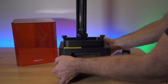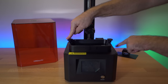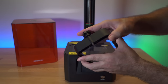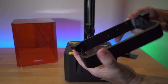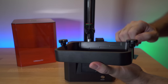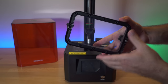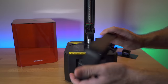I want to take off the tub to look at it closer. I'm spinning the coupler by hand to raise it up. There are two knobs, one on each side — they're not meant to come out, as they're solid on top but threaded on the bottom. Here we have the tub, also known as the VAT. It has interesting marks and steps for gauging resin level. Bolts around the bottom compress the film, which is extremely tight — it literally plays like a drum — and it has to be, because the model prints through it each layer.